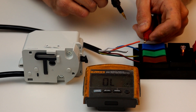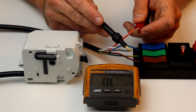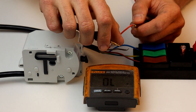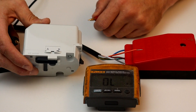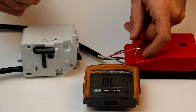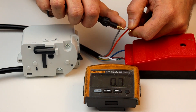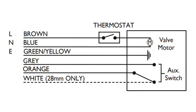The ZA6 follows the same logic with the brown wire driving the motor, however there's an additional white wire. This is a normally closed contact with respect to the orange wire. In the A position there is continuity between orange and white but open circuit between orange and grey. When the actuator completes its travel to the B position, continuity is lost between orange and white but is gained between orange and grey. From this you can see that the switch contacts are volt free and not influenced by the mains voltage on the brown wire used to drive the motor.